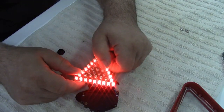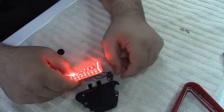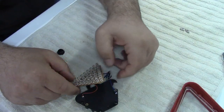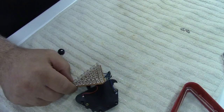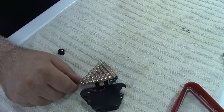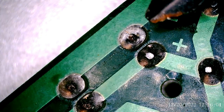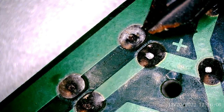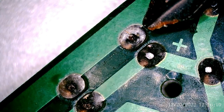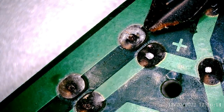And you see when I twiddle it, it works. So I think what we're going to do, because I have it, is we're going to get the microscope and take a look at the scope cam and see what that shows. So take a look there, right where the screwdriver is pointing. That is the broken solder joint on the board. You can definitely see that it doesn't look like the rest.